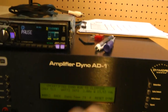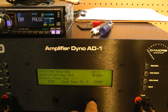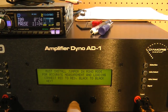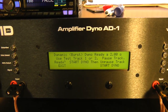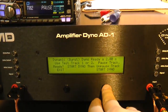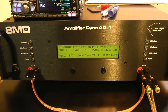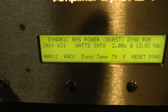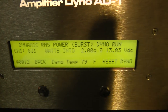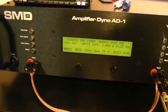Alright, so one more test for you guys. Let's go ahead and reset my track here and do the dynamic power run, mono at 2 ohms. Start dyno, start the track — let's see what she does. 631 watts at 2 ohms, 13.83 volts. Well, there you have it guys.